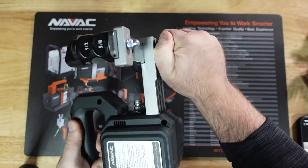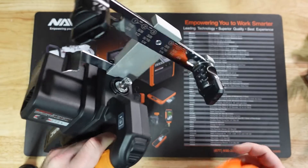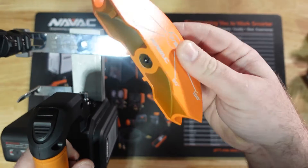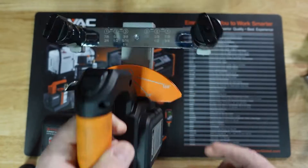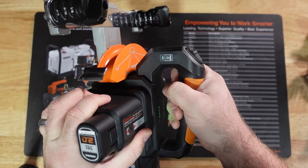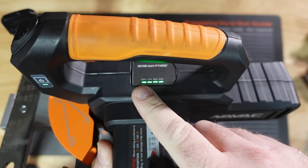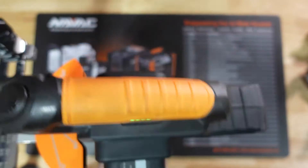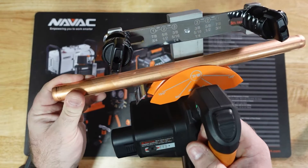Ensure that's nice and finger tight — as snug as you can really get it with your hand. Once that is in place you can see the beginning of our drive rod stubbed out right there; that is where our mandrel will be placed. It will also make a positive click sound when it seats and our tool is just about ready to go. Right on the side here we've got our power button — press that on. Once the power button is turned on you will notice under the handle is our battery life indicator showing 25% increments from 100% down to zero. We'll double check that the tool is on and then slide our copper into the mandrel.